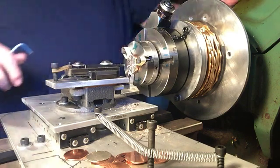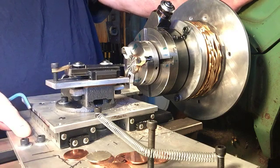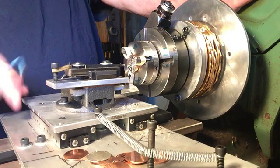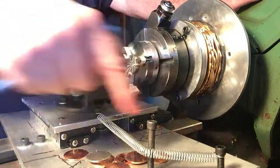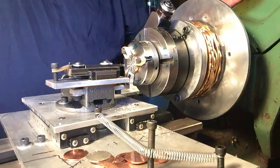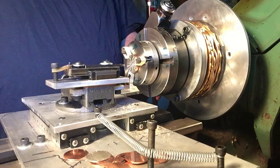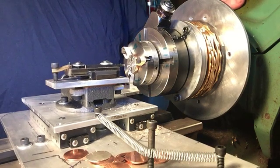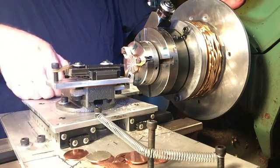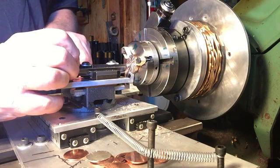I'm planning on rebuilding this. I'm using some quarter-inch aluminum plate for the base, which is adequate, but for the support plate I should have used three-eighths or half-inch aluminum. I'll probably swap this out, especially since I want to add a little more surface to add capabilities such as a tower on the backside, which basically reverses your image. I'm not trying to be a clock maker in terms of the degree of precision, and my results are absolutely adequate.